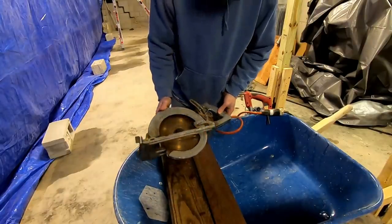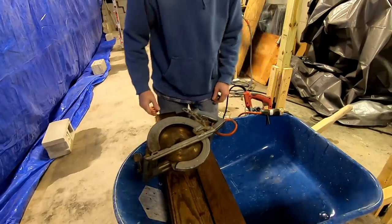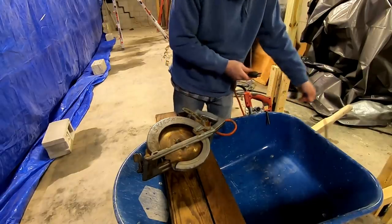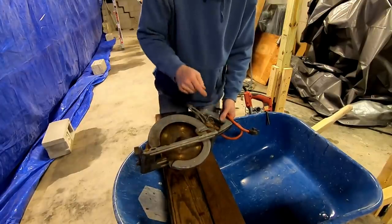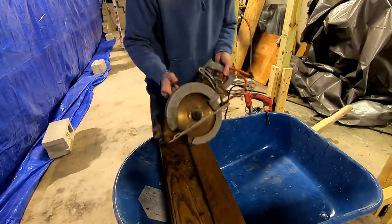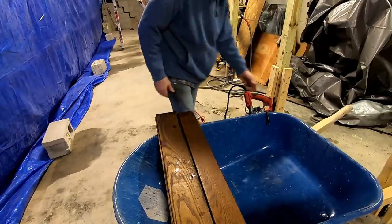It just tripped a breaker and stinks. So obviously, bad shape. It needs new brushes. Well, I'm going to unplug that. It needs more than new brushes, it needs brushes and it needs the caps. Obviously, you see, no blade brake. It just doesn't work. So I picked up a new one.